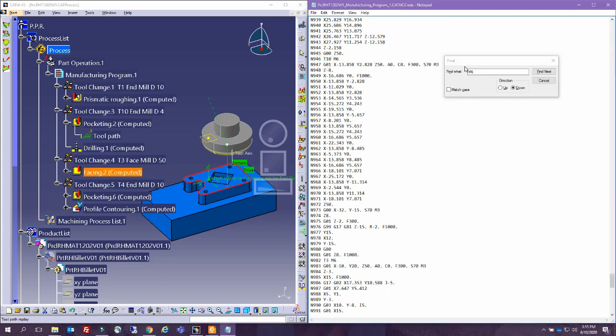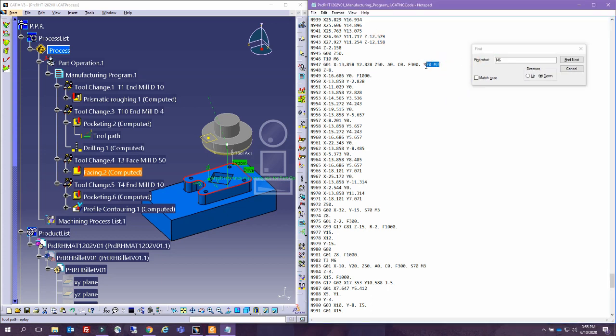Okay, here. So this is the tool. We set the spindle speed forward, we set the feed rate. Of course, the A and C axes are 0. There is no angle tilting in here. And we go to a certain point, then we go Z minus 8. If you remember, this Z minus 8 comes from the programming.